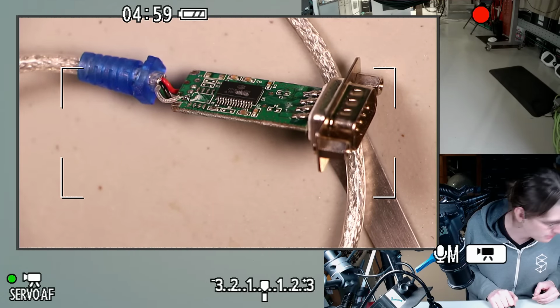All right. Well, maybe we can at least unsolder a few of these and then wire it up to the VFD. I'm going to leave the USB cable on for the moment just because it's more convenient for testing. But I want this DB9 connector gone. So in order to sacrifice the connector and hopefully not damage the board, I'm just going to cut the pins at the top.